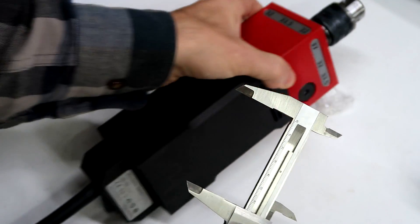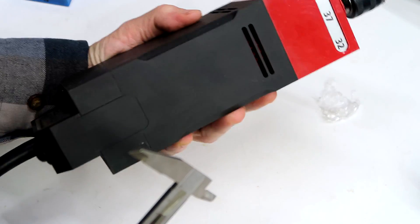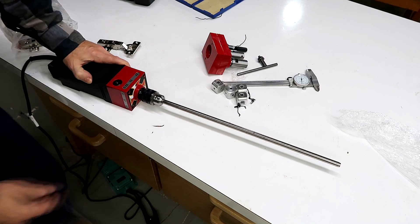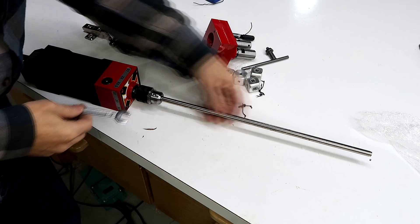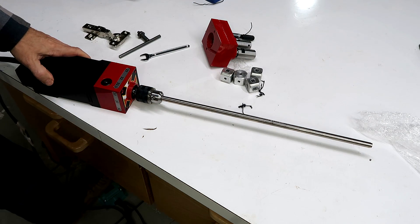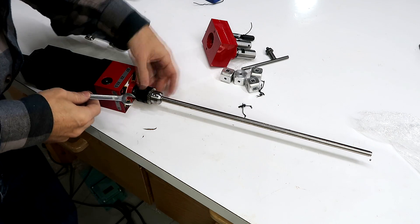I'm guessing it's the thickness of the paint. The back is about 0.04 millimeters over, so that's not bad. For a test run on this chuck here, I need to tighten that down really good, and that needs a 12 millimeter wrench — a fairly thin one. I didn't have one, so I just ground out a 10 millimeter wrench. Let's tighten that up good and try again.